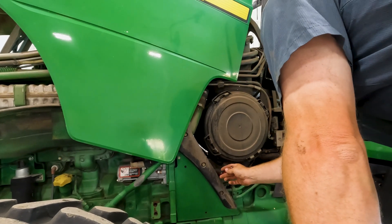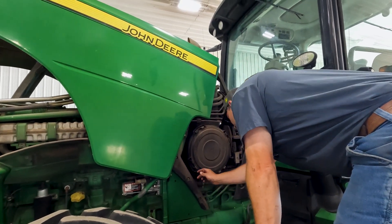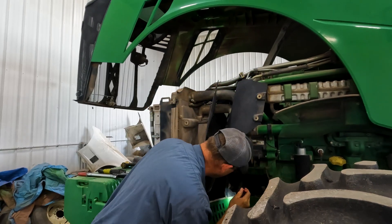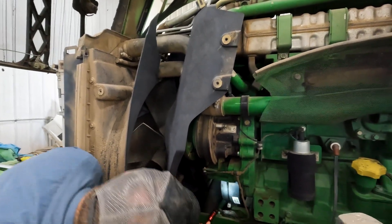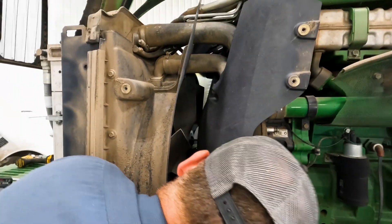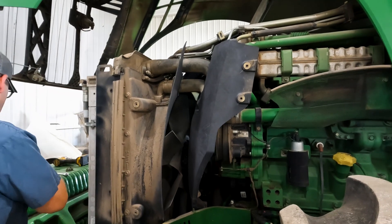Has it been checked before? Yeah, this dampener has been replaced. It's not green and it's in good shape, I would say. So these dampeners have also been replaced. Obviously they're black, so that means they're a replacement. The fan drive has been replaced - it's a dry type driver on here already. So we'll check the drive and go from there.